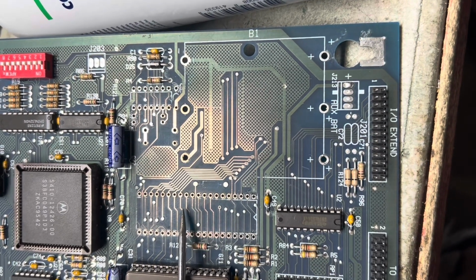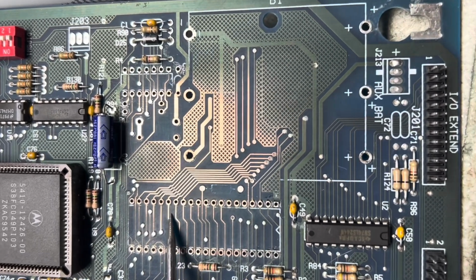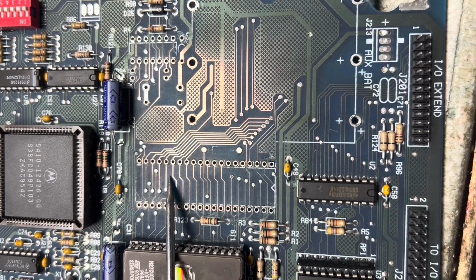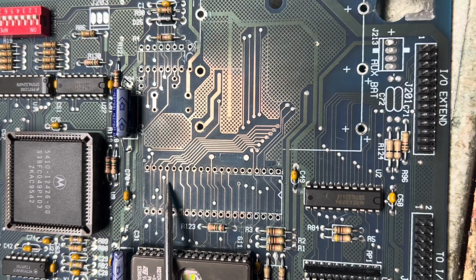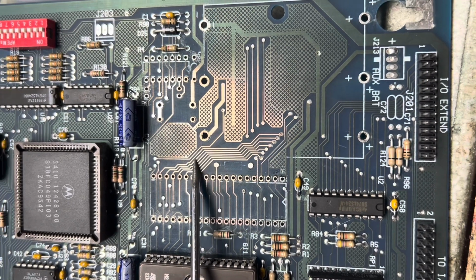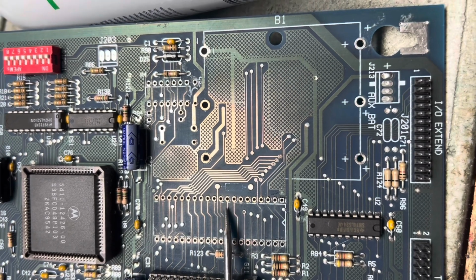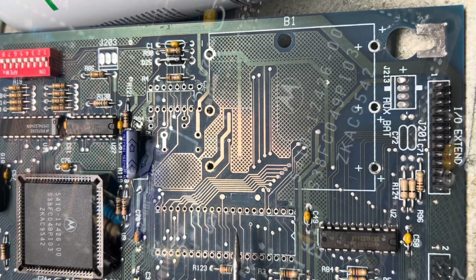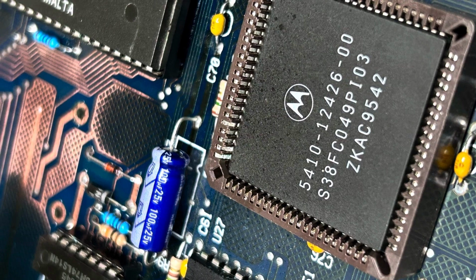You have to conformal coat before you start putting components back on. Obviously, if I put a component on there and then conformal coated it, these traces wouldn't receive the conformal coating. Also, you want to take advantage of the conformal coat creating a solder mask between these adjacent traces so that you don't get solder blobs. It's not too bad on WPC boards, but like System 3 through 7, the ROM sockets are terrible for that. Notice the corrosion on the left side of the ASIC socket.